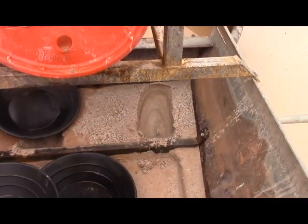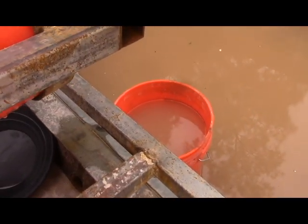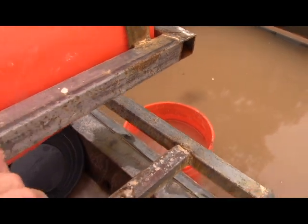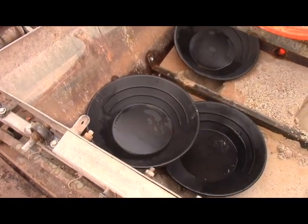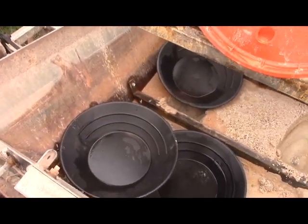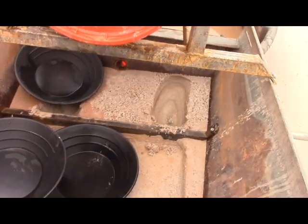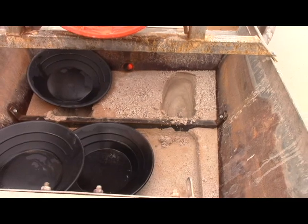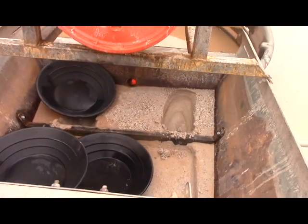In the tailings bucket, I panned the last two buckets — the top layer on each one. Quite frankly, you wouldn't have been able to see it in the pan anyway. The second-to-last bucket had no detectable gold. The last bucket had two specs in the three to four thousandths range, and that was it. So even though there's quite a lot of gold concentration here, very little is escaping out of the outfall because it's working its way into the semi-fluidized bed.